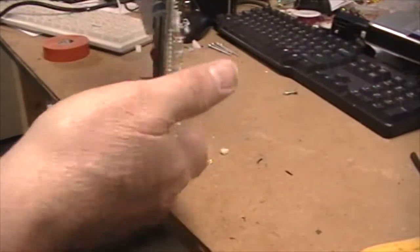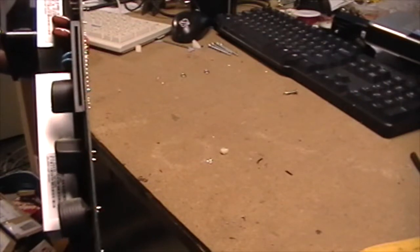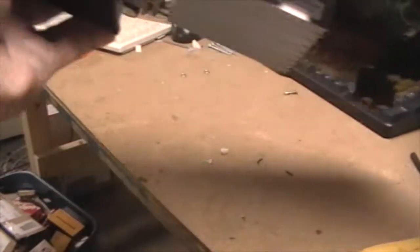It's called a YPPD J015c. I don't know if you can see that or not. Let's go ahead and zoom in on the label so you can pick up that part number. YPPD J015c. This is the module that keeps popping. There's a module right below it, the J016c. I never had that one go bad at all.